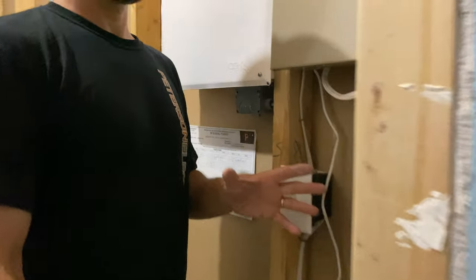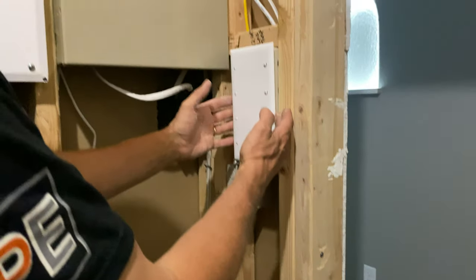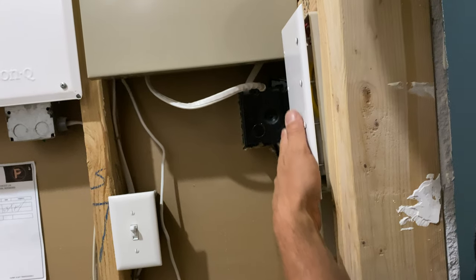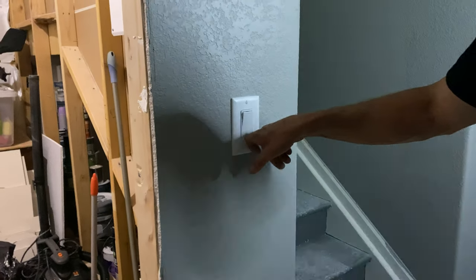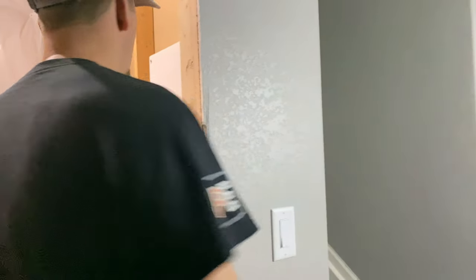Here's my little secret: power comes in on its own circuit just for the fridge outlet in here, because they are putting a little freezer right in that corner. Keep that in mind — you can do a freezer. Then this power comes in here to an LED transformer that fits in a four-gang box back-to-back. I like to keep them a little more open so my transformers can vent the heat. This is an unfinished area, so a kid isn't going to get shocked. Right here is my switch that turns the transformer on and off for that indirect lighting.